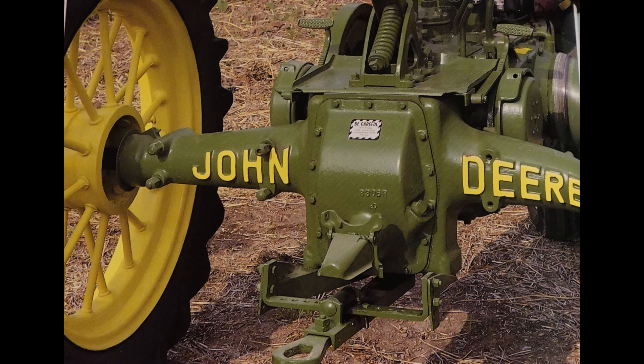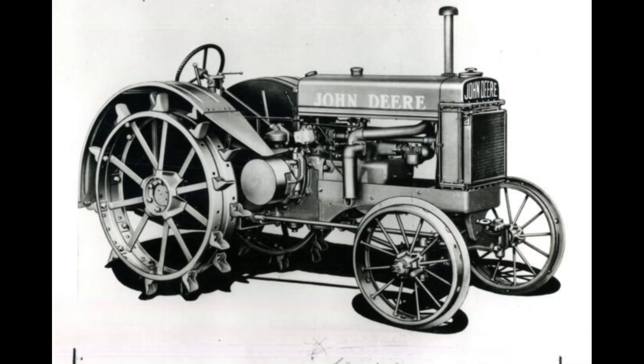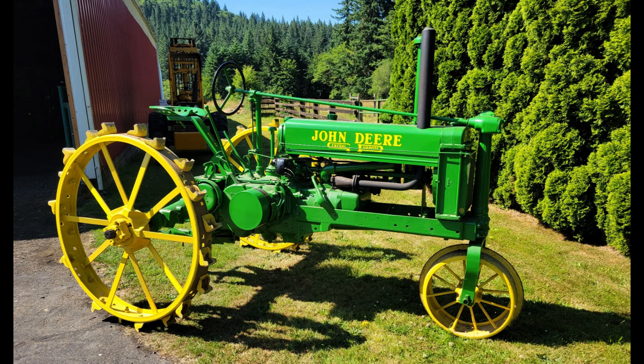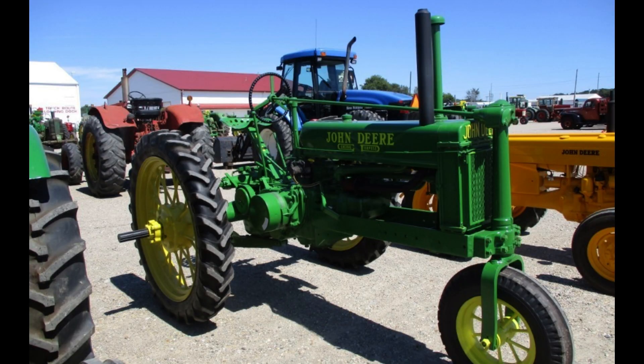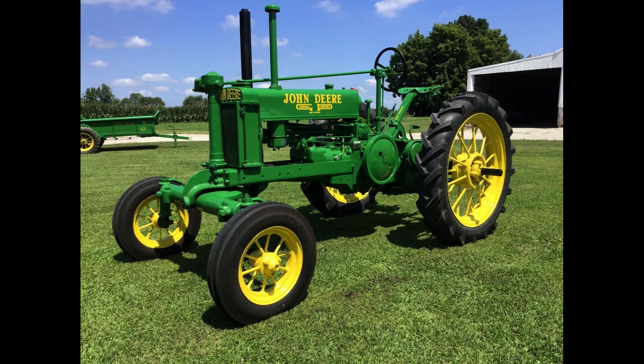To start this tractor it'd be the flywheel hand start, just like the Model A. Upon release you'd have four main variants: the most common being the narrow front end, as well as the BR which was a fixed front axle. You'd also have the BN — this would be a single wheel front end. The early ones of these would get nicknamed the garden tractor or the vegetable model, with 1,001 of these produced. You'd also get a sub-variant, the BNH, which was a high crop with a narrow single front wheel, released the following year with only 65 produced. And last you'd have the BW, which was a wide front adjustable for row crop, with 247 of these built.